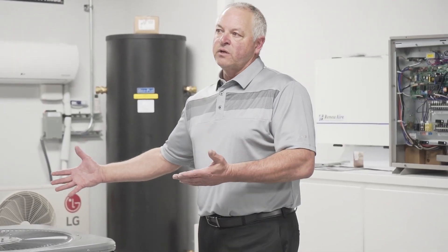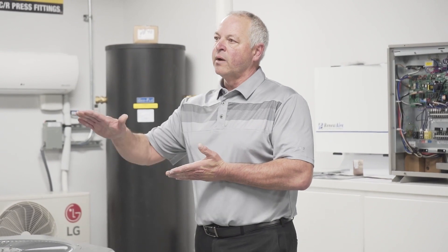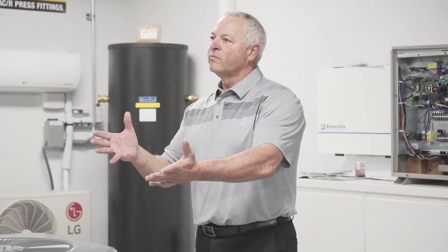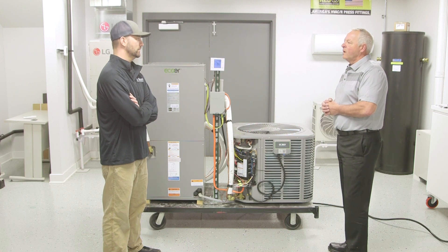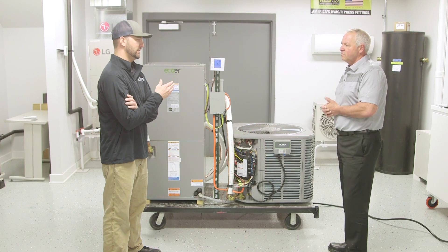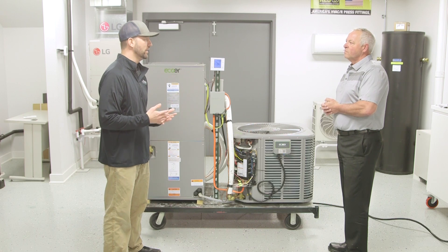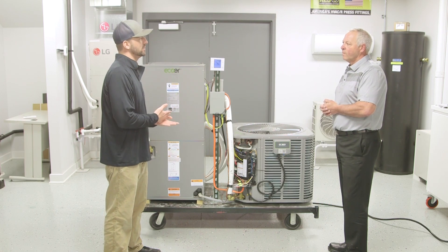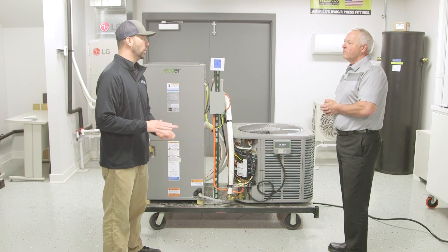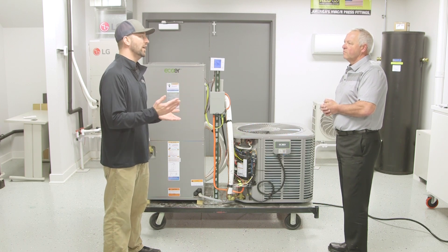What caught my attention about this product is the simplicity of how it is installed. When I started my career about 14 years ago, inverter technology was just starting to ramp up. What's your favorite product when I say inverter? Usually a mini split. A mini split — yes. And your experience with the mini split? When it comes to inverter technology, it's just more longevity of runtime and dehumidification. In Iowa we get really humid summers, so that's a big selling point. Also energy efficiency — it runs at lower speeds on milder days, so you're not running at 100% capacity on days that don't need it.